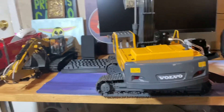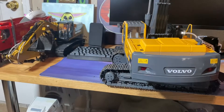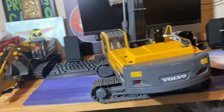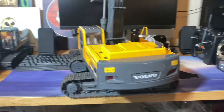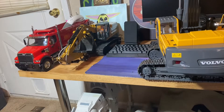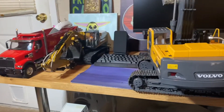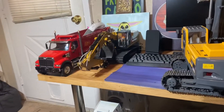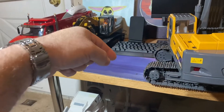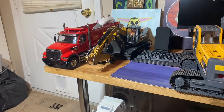Sorry about the dig video — there will be another one, weather pending. I want to show you guys that you can literally roll this out to your yard and start digging. It proved it digging through vines and the toughest dirt I could find. I think the yard would be easier. This machine can use the ripper attachment on it — a lot of folks use the ripper and bucket combo to dig anywhere, because some dirt is so compacted it's extremely hard. It will still slowly dig in it, but you just attach a ripper with a quick disconnect, rip it and dig it, rip it and dig it, and tear right through. You have quite a few options with this machine.